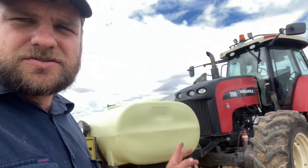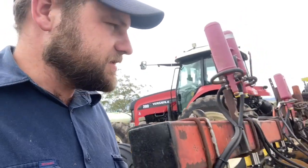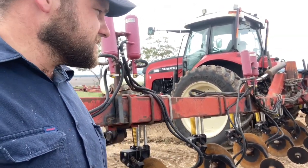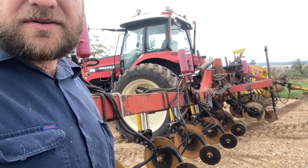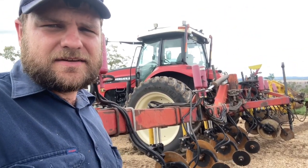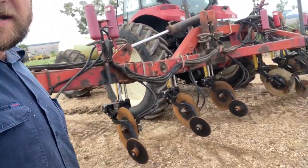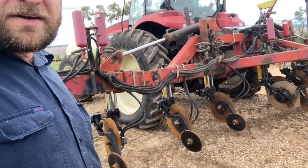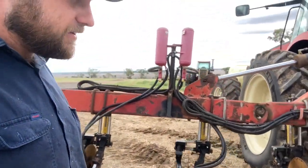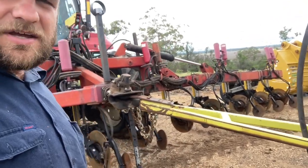The 280 here is fixed — put the harness in and hooked it up just to this gas rig here, and it didn't have any issues. We've just been going through this; we're finished with it for this season. We've gone right through all the bearings and checked them all. I had to replace one of the bearings for the discs — one of the covering discs that are behind there had a crook bearing. So we've got that done, just going to check it all over to make sure it's ready to go for next year.